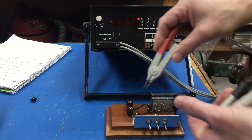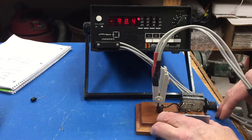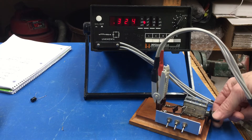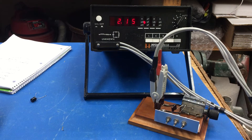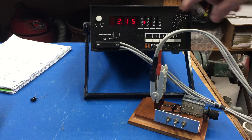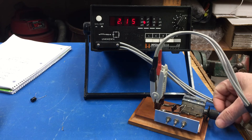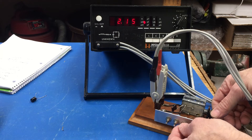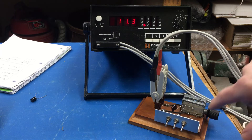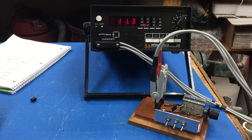Here's the tuning variable. I'll show you how we arrive at the high and low frequency this loop will cover. With all switches in and the main tuning capacitor fully meshed, we have roughly 2,150 picofarads of capacitance. With all additional capacitance removed, the residual is 11 picofarads — that's going to determine the high frequency at which this loop resonates.